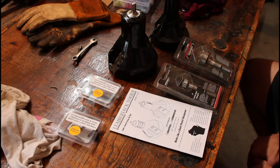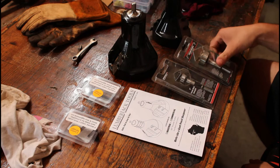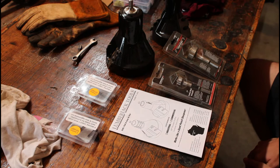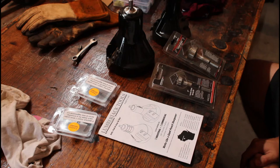You can buy these separately — you don't have to buy them all as a kit — but I went ahead and bought the 1 inch and 2 inch kit. So here's the 1 inch Forstner bit and the 1 inch tenon cutter, the 2 inch Forstner bit and the 2 inch tenon cutter. They come with one set of blades per tenon cutter and then some shims. The manual describes how to use the shims and the setup. They do work like a giant pencil sharpener — pretty basic tools.